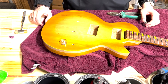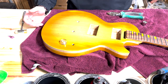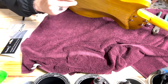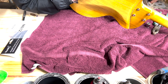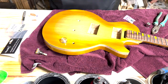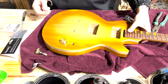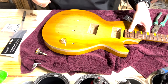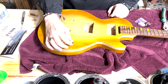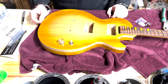Now we're going to install the little switch that goes right here. Again, this is on the list of things I think are not going to be complicated and take all of 20 seconds. But we need to widen the hole just a little bit — no big deal. We're turning into another ordeal. This happens whenever you design any sort of product, but I've learned a lot from building this guitar. I need to open up these holes just a little bit when it comes to the CAD drawing. So ream this out, make it a little bit wider, and we're going to slip the switch in. If this switch broke after just a little bit of that, I would be very suspicious of the quality.